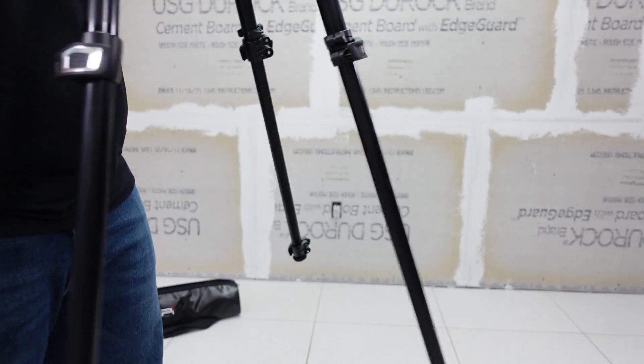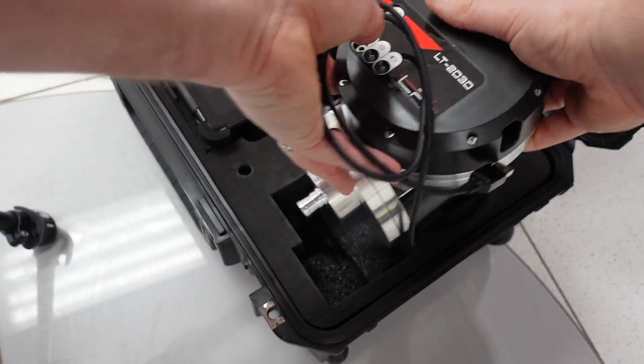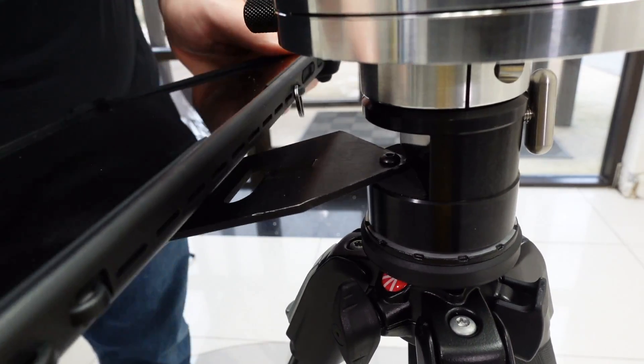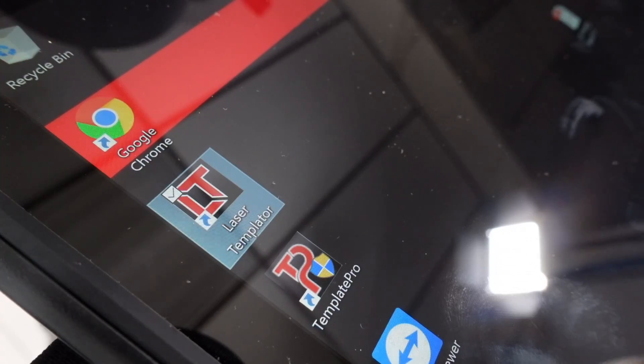Set up the tripod in a central position that allows for visibility to as much area as possible. Open up the case and carefully set the laser head in the pin slot and tighten down. Then bring out the tablet and connect via the pinhole. Turn the laser on first and then connect the USB cable to the tablet before opening the LT software. We've discussed with the customer installing four panels — two above, two below — with a single T intersection for our joints. When we gather our measurements, we're going to offset between each of those panels exactly the amount we anticipate our joints to become on installation day.